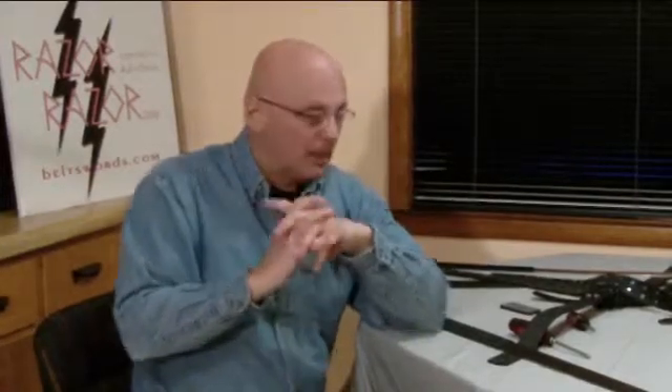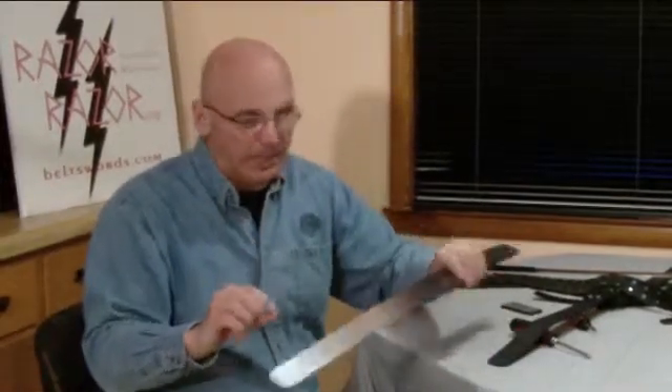As in a tape measure that's very thin, you can bend back and forth. Can you imagine making a tape measure out of a quarter inch steel? Well, it wouldn't bend, and if it did, it would bend permanently. So we take several thinner blades and make one heavy, heavyweight blade from this.